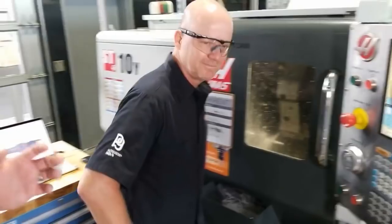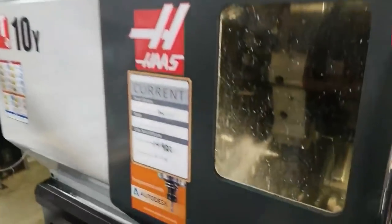Yeah, we did practice yesterday and made sure all the equipment was working with our computers and lights and all that kind of stuff. And I did learn a lot from Angelo, even from listening to the sound of the machine. As you have a certain diameter of material, as it's cutting in, it's changing the speed of that material to keep a constant feed rate, so you get really nice finishes. It's pretty amazing. All of this is automated.